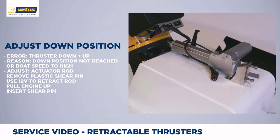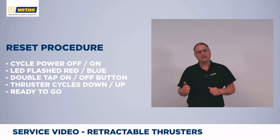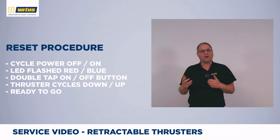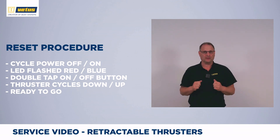Put the connector back in, cycle power on and off, and make sure that the system performs its self-test by going down and back up — then your system is fully functioning again. Be aware that if the system has thrown an error or protective code and you switch the power off and back on, activating the thruster will always give you a blue and red LED. The blue-red indicates it is going into the self-test motion to find its calibration point, going down and back up to confirm everything is fully functional. If you still get an error code after that, check the adjustments we have just made.